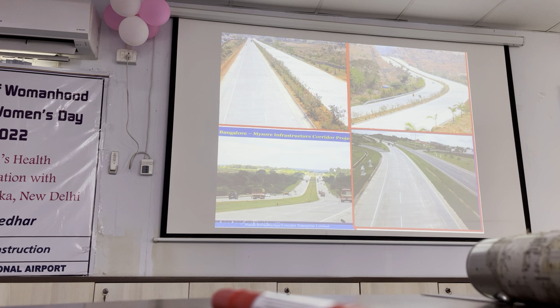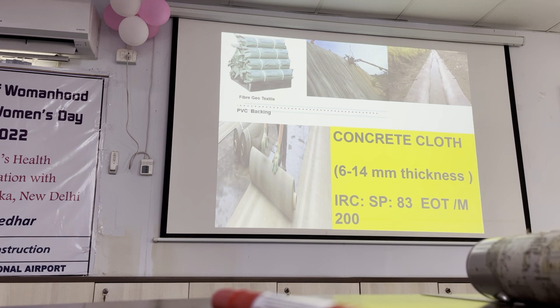What is the difference between white topping and rigid pavement? This is Bangalore Mysuru Expressway - 180mm thick only, one meter by one meter panel, no tie bar, no dowel bar, no polythene sheet, no DLC. Existing bituminous layer and toe 150mm. Work is still going on today - anybody who wants can go to Bangalore Mysuru Expressway. Nandi Infrastructure is the contractor; Mr. Prasad is the vice-president, so we can check with them.